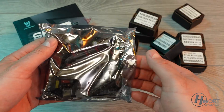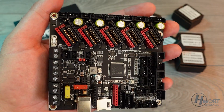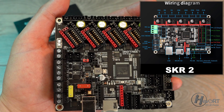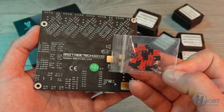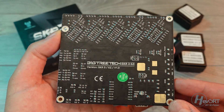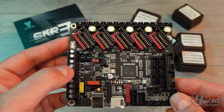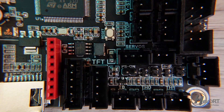Let's have a look at this board — we'll open that nice little bag. Wow, I'm stunned. It's really good looking; everything is laid out perfectly. The first look suggests a pretty quality board — it reminds me of the SKR 2, the component layout looks very similar. We have a small bag containing jumpers of two different sizes. The back of the board also shows the pin numbers and everything you need to know to make the right connections. The driver connectors are quite different from what we're used to — they have two types: step-stick and easy driver.